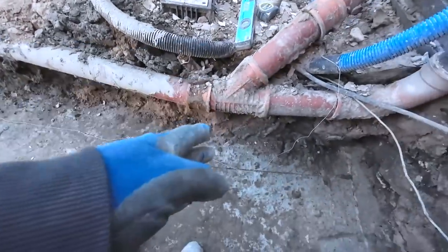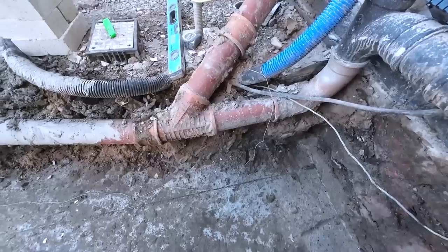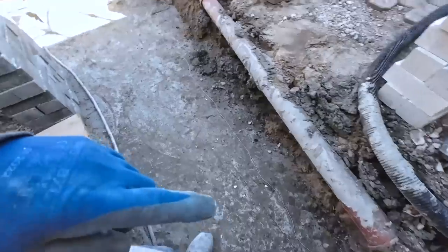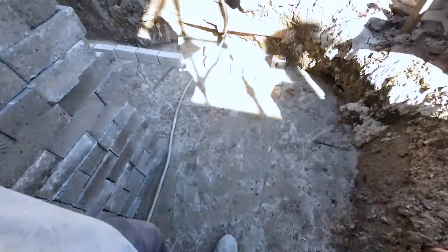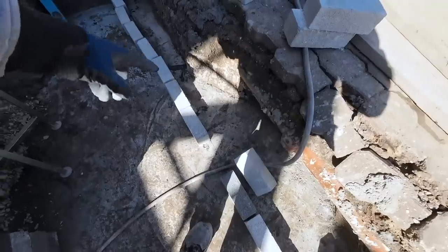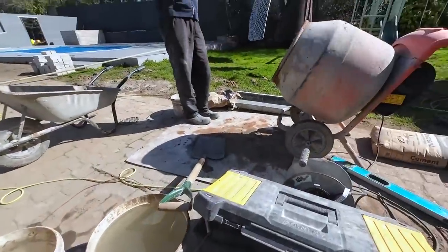We're putting 2 lintels in here to take this duct and this duct through back into the plant room. I think that's power and stuff to the swimming pool. Then a straight run, then roughly about three brick in, and then we're going to leave about 2.5, maybe 3 brick wide opening. We've got 2 4 3 concrete over there for that.